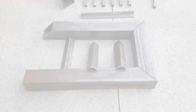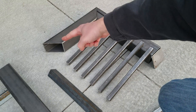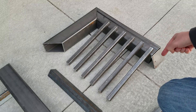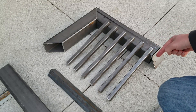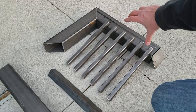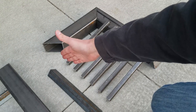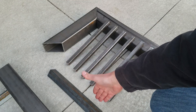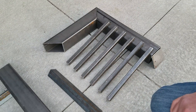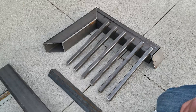Let's go ahead and show you the upper part. The air is going to go up into here and then to here. I'm going to weld this cap on so that the air doesn't escape through there. I'm going to drill six holes for these six pipes, which will go over the fire and come out the front of the fireplace. At the end of the fireplace, I'll put this angle iron just to support the pipes from bending. As the air goes through this entire system, it will be heated up and pushed back out into the room.